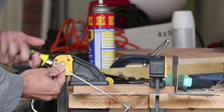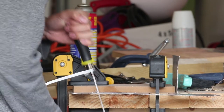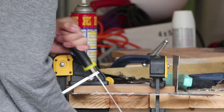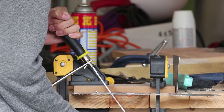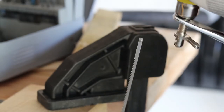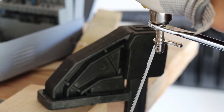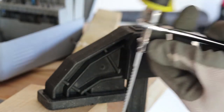For the specific project I'm working with 22 gauge steel, and both the coping saw and the hacksaw cut on either the push or pull stroke depending on which way you orientate your blade. I normally like to use the push stroke because I find I have more control over it. You can tell which way the blade cuts by looking at its teeth — they point towards a specific direction, and if you follow that direction, that's gonna lead your cut.